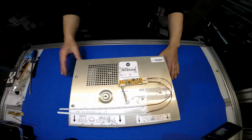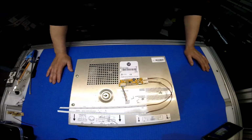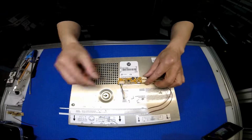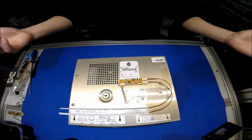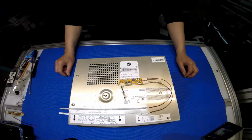Hello, in this video I would like to show you how to repair and upgrade this 10.4 inch Allen Bradley 1000E from CCFL to our UB54 series LED kits. This kit comes with two LED strips, one small driver MS610 and one wire adapter. So basically you don't have to do any rewiring of your inverter because it's just plug and play.